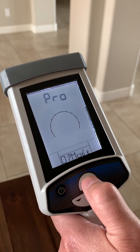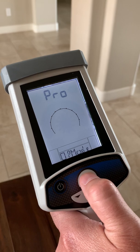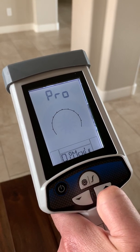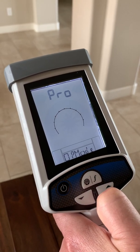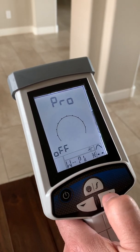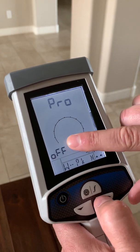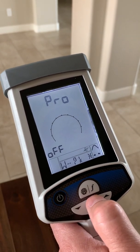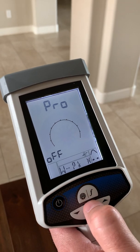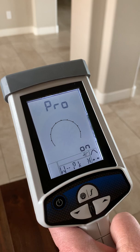Op mode is where you add different modes of operation such as peak, null, refined peak, sonde, etc. To enter any main menu item, press the gain up button. Here you can see wide peak with arrows is off. To turn it on, do a long press of the frequency mode button — one, one thousand, two, one thousand, release — that toggles it on.